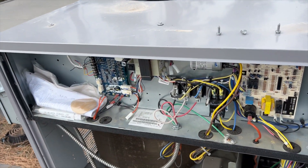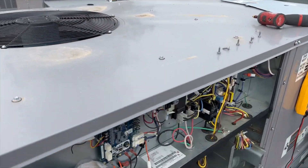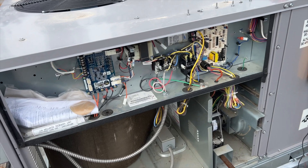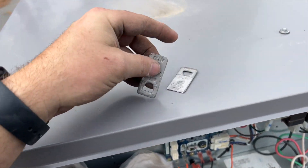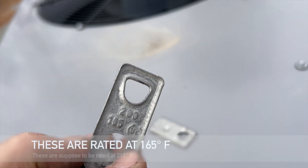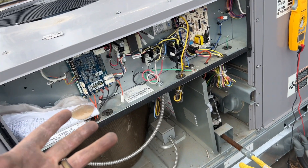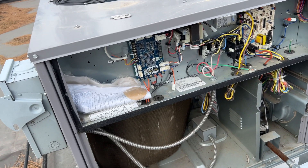Using PVC temporarily to hold the dampers open until I can get new clips. The thermostat on one unit isn't kicking on — the disconnect is off. The other two have airflow again. I'm going to disable those fire dampers until I can get the new hardware. These fusible links are welded together and hold the damper open. If it gets too hot, the solder melts, the link pops, and the whole damper falls closed. These are rated at around 165–200 degrees. That's why all three closed, and this coil is completely plugged.